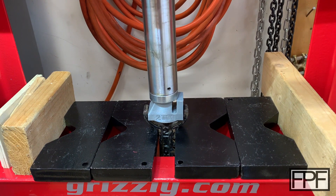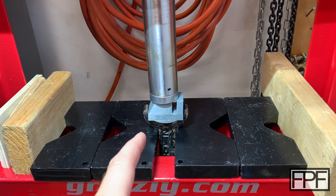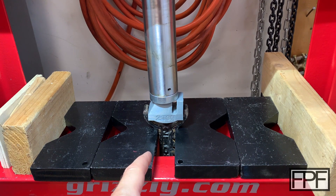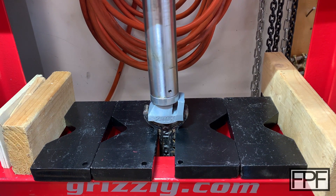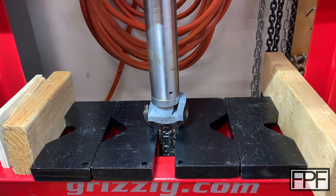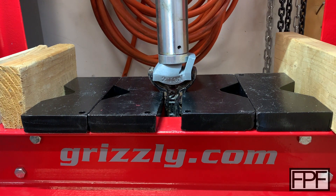We're lined up in the press and I'm just getting the ram tightened up on top of the piece so we can start applying some pressure. What I'm hoping for is at least one ton before we see any deformation, and up to two tons before any significant deformation — basically matching the rating of the jacks. They're rated in a pair, so each one should take one ton no problem, and I'd like to see two tons for a 2x safety factor. Unfortunately, pretty much as soon as I start to apply pressure, this guy is just deforming terribly — it's already deformed about five millimeters. I'll move the camera down so you can see just how much it's deforming. Even applying more force, I still can't get the gauge to read anything — it's still at zero. So we're definitely going to need a version two.